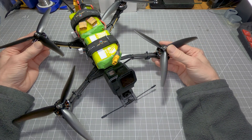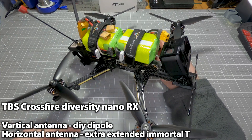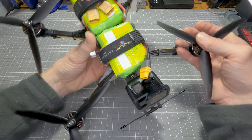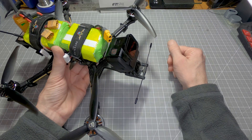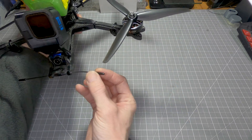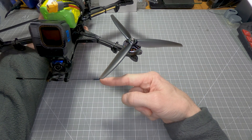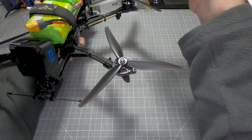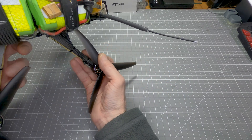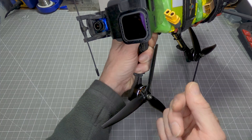The control link I didn't talk about last time: I always use a diversity receiver for my long range builds, so I've got a vertically polarized antenna in the back and a horizontally polarized antenna in the front. This gives you the best chance of maintaining link no matter what orientation the drone is in — you always have an antenna at a good orientation for communicating back to your transmitter. It makes it much less likely to lose control link when you happen to be pointing the null tip of your antenna back home, since that part of the antenna has a very weak signal. If you're behind some trees a few kilometers out and pointing the antenna null back towards you, you could actually failsafe. But with the diversity antenna, the other one will take over and give you a good strong signal back to the home point.